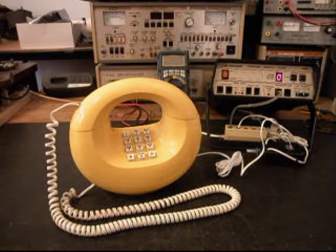We're going to do our final checks. We also installed a bridge rectifier in this circuit so that no matter where this telephone is plugged in, it will always be proper polarity and polarity protected. Before, it didn't have any kind of a polarity protect circuit — if you plugged it in one jack it may work right, and if you plugged it in another jack it may not work right. But now you never have to worry about that because it has a bridge rectifier, a polarity protect circuit that's been installed.